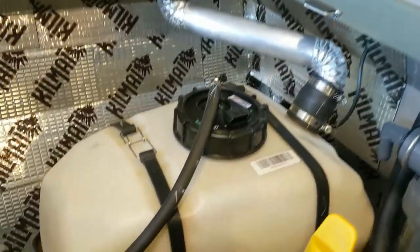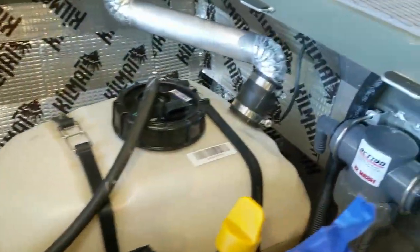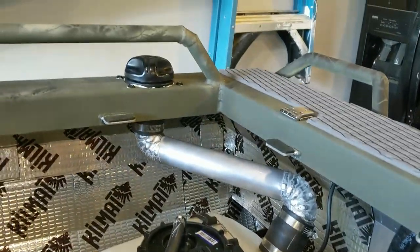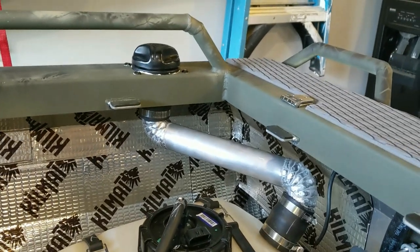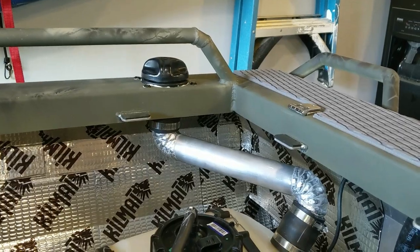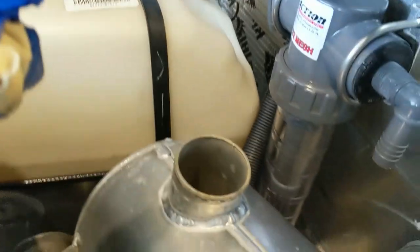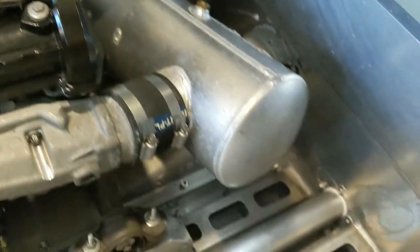All right, well, the fuel system is now completely installed. Got the tray bolted to the holes I put in the stringer. And I sealed the gas cap with Sika so water doesn't fall down into the hull through it. And yeah, got all the hose clamps tightened and the straps put on. So next is the exhaust.